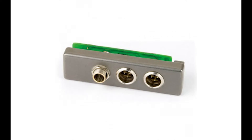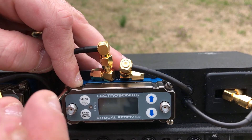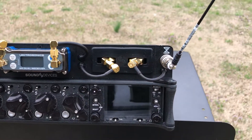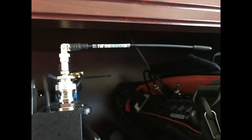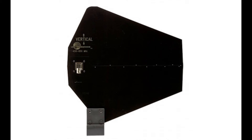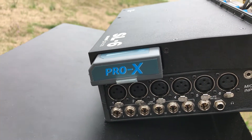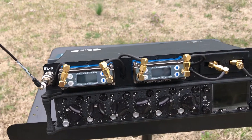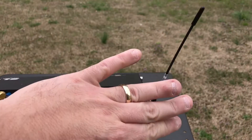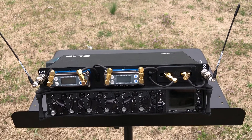You can get a backplate option that has two TA3 outputs and a power input if you're using it by itself in a bag. When you integrate this into the SL6, the SL6 has BNC connectors — I have whips on mine, but you can also run BNC cables out to shark fin antennas. It has a slot for a built-in NP battery which powers the SL6, your receivers, and the 688. It also has RF distribution built-in, which is why you don't need whip antennas on the individual receivers. You have your two main antennas and the unit distributes that signal via 90-degree SMA connectors that screw onto the SRC.